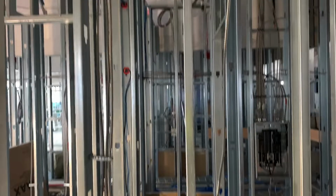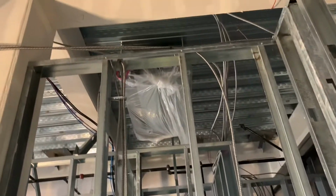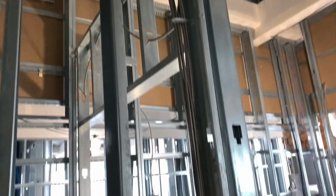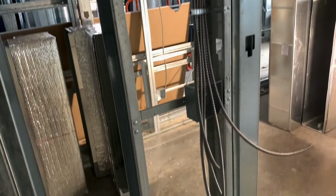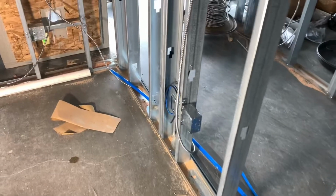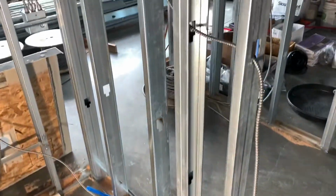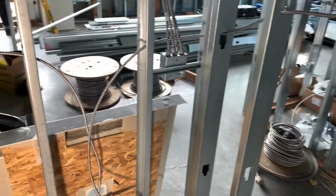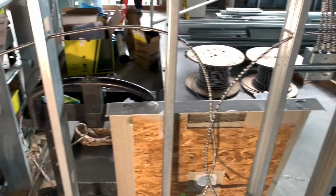But basically, right now, just taking the power from each box from the home run from the bathroom, switch to the plug in the hallway from this second switch box for the closet. So I got 5 wires here: power in, power out, and then 2 switch legs. Then taking the power from that switch box over to this plug over here, and then just wrapping that around the whole bedroom for all the plugs. So basically just power in, power out for the plugs, because that's all you need.